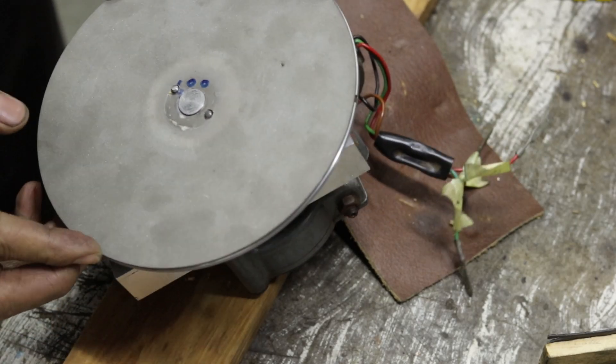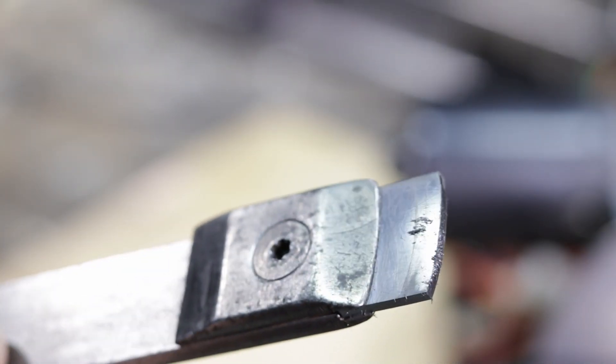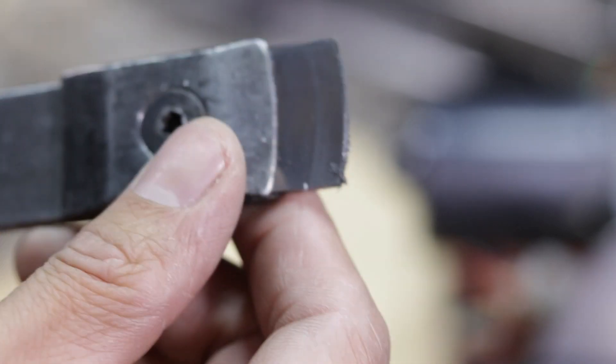And — yeah, that's actually pretty good. The only downside to using magnets though is that your scraper will often get magnetized and collect all the little chips that you scrape off. So some kind of demagnetizer might be required.